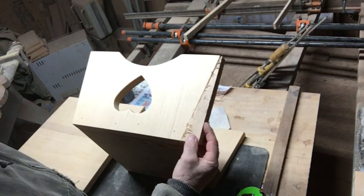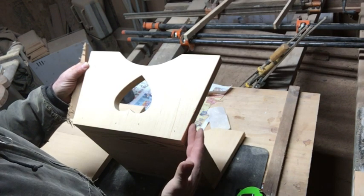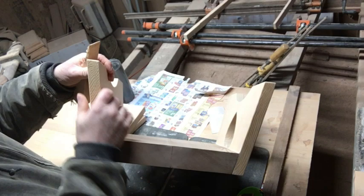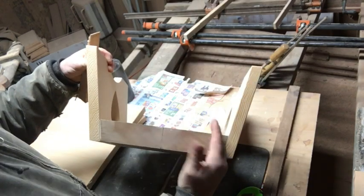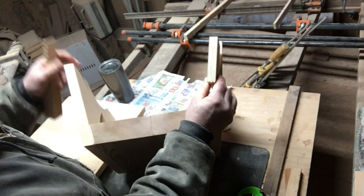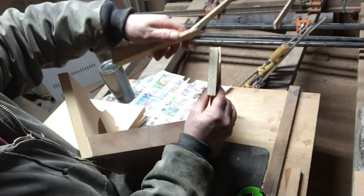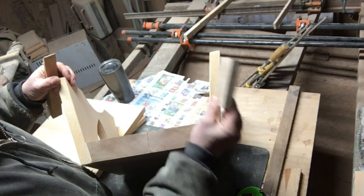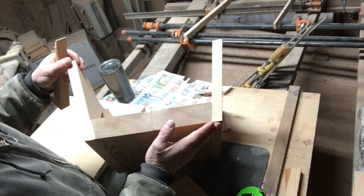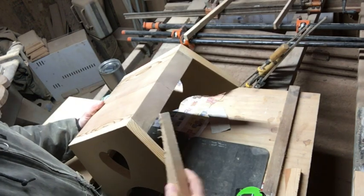Everything on here is measured at either 90 degrees or 10 degrees. This angle here that runs flat across is 10 degrees, because in order for this to be level or flat with the ground when I bring the leg out like this to 10 degrees - when it goes from 90 degrees this way to 90 degrees this way on this cut - this edge right here would be the only thing touching the floor. So we also have to cut this off at 10 degrees as well. This is 10 degrees cut on the end board, and this is also 10 degrees cut on the top of this end board.